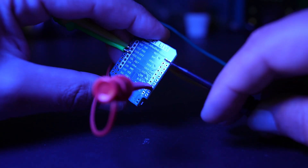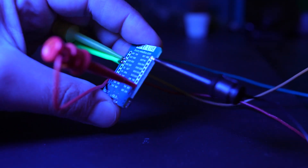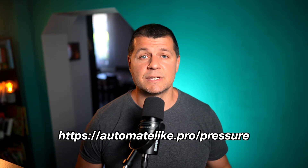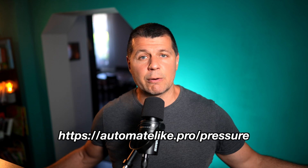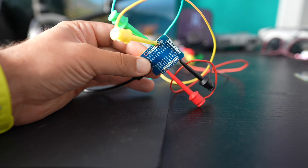Before I reach the Home Assistant part I have to overcome some obstacles. First, I need to decide how to wire the sensor and to what board. I'm using test clips that can be attached to any board in just a second, and I found quickly a working wiring solution. You can get my free PDF that goes with this video — everything is well explained there. I also decided to use an ESP board like the D1 mini because of the better I2C support.